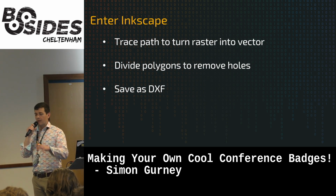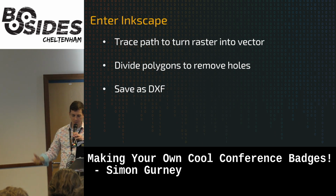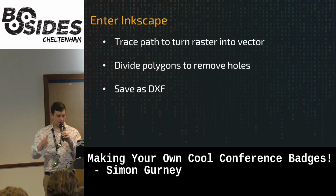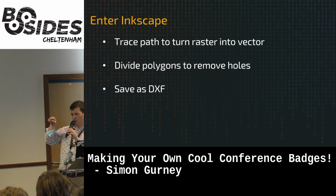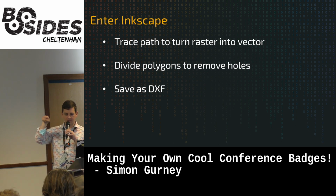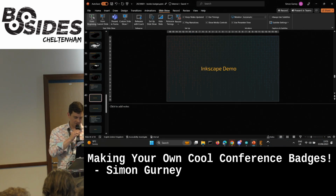Basically, there's an annoying thing where in Eagle, a thing can't have a cutout. So say you want to put the letter O onto a board, you can't just put the O in because that middle cutout it won't see. You'll just see the outer one. So we have to slice the O so it actually becomes like a C that's been closed up, right? So it's just one big outer edge rather than being two edges. Okay, let's just do that. It makes more sense than me gibbering about it.